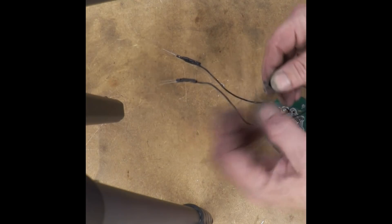To make the rectifier circuit, you need six diodes. Take three sets of two and put the silver band to the black band, give it a twist, and repeat that for the other two pairs. You'll end up with something where each wire has two diodes at the end — one with the silver line and one with the black. Take all of the black ends and twist them together, and in that mix put a black wire, because those are your DC negative out. The silver ends go to the red wire — that's DC positive out. You deal with all brushless motors the same way.